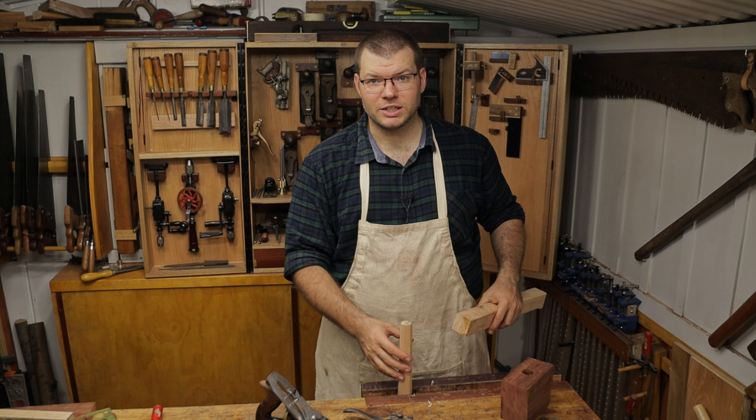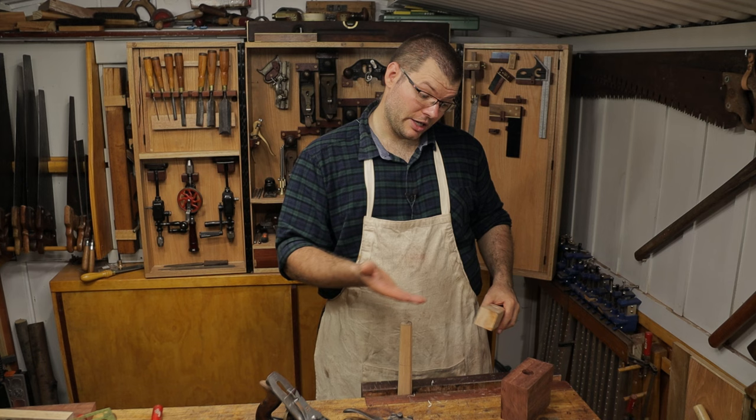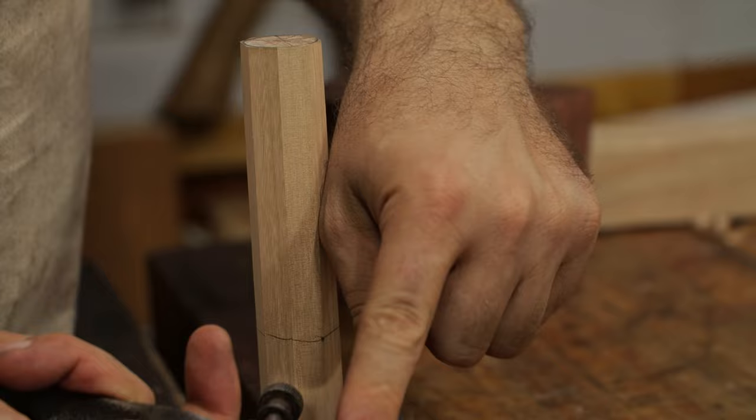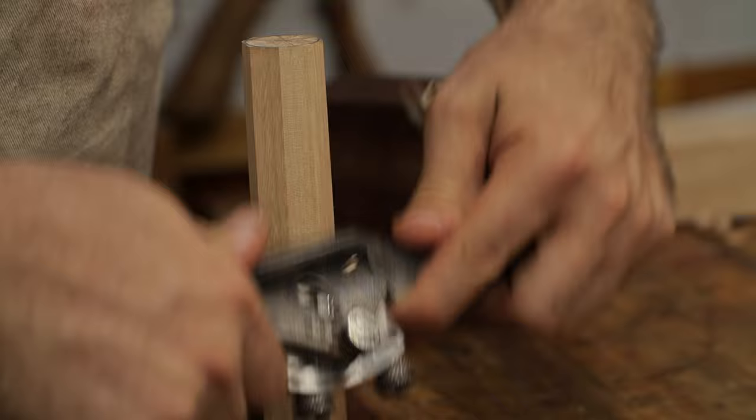Now, because this is going to be wedged at the top, I will need it to be a little bit narrower right at the top to allow for that wedge, just to splay it a little bit. I have a very fine setting on my spokeshave here, and I'm going to run up these radiuses like this to start with,